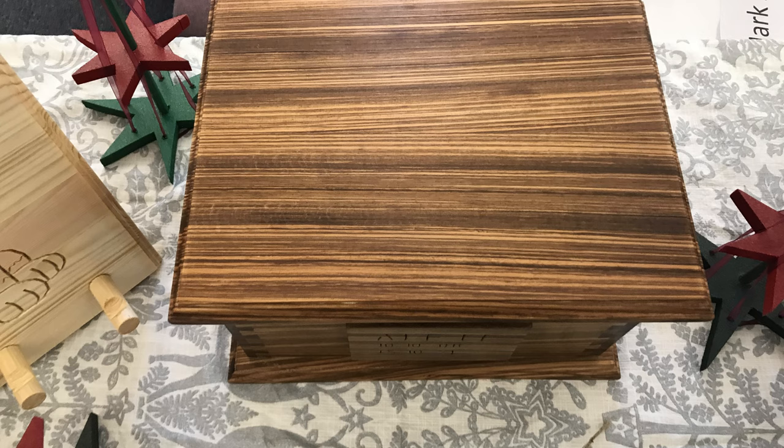The sanding process was starting from an 80 grit, and then working my way up to 120 grit, and so on, about half a dozen finer grits, until about 600 grit. If you're producing a fine piece of furniture, then it's just as important to take your time in finishing.